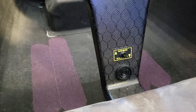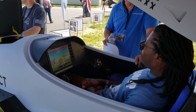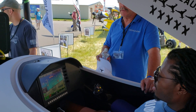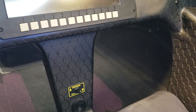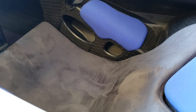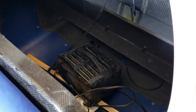You notice the long nose on this thing — that's a lot of leg room. In here you just have one screen. Being an experimental, you'll have options for your avionics, but what's being fitted on this and likely a good option for builders is the MGL, because you can tailor it to your fit and what you need in terms of features. The cabin width is about 37 inches at the shoulder area. It's a small single-pilot jet but you still have some room to put things in the back.